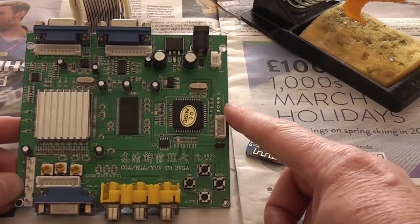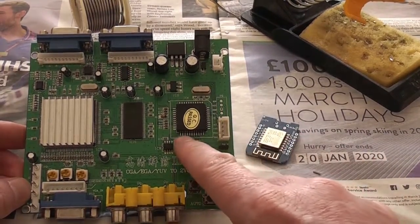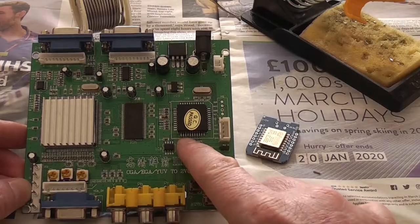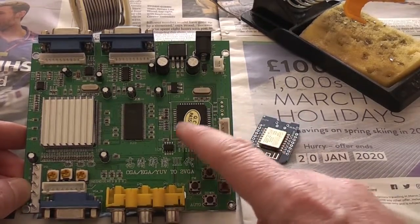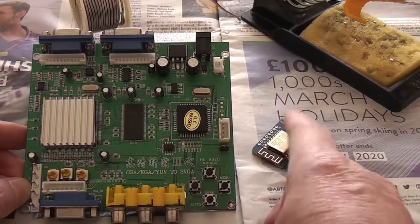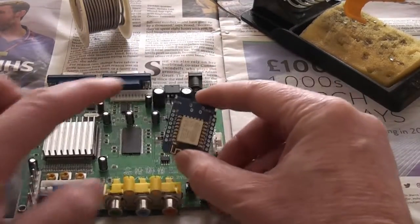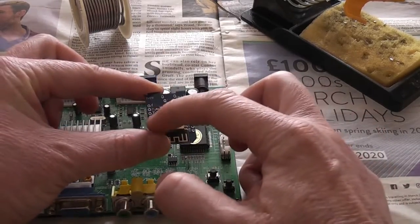And then the 5th wire is arguably even more problematic because it's the second from the left pin here on this chip. Second from the left pin is the so-called debug pin. I need to connect that up to give, again, a second sort of data input onto my module there. So 5 wires to be soldered to this board, and then they connect up with various pins on the side here.